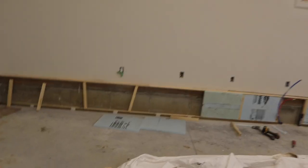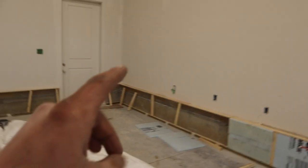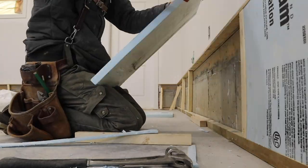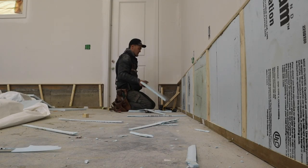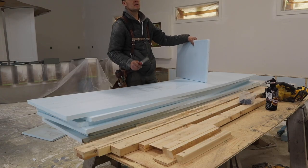That way you can pre-cut a big stack of insulation panels and everything is loose. Do one item at a time, do it fully, then move on to the next item. I put all my top pieces on three and a half off the wall, ran back, did all my bottom plates, did my framing members, and now I'm going back and installing it all at once. It's a lot quicker than jumping back and forth between tasks. If you have to move the hammer drill 40 times with your skill saw and drill, you're not going to be very efficient.